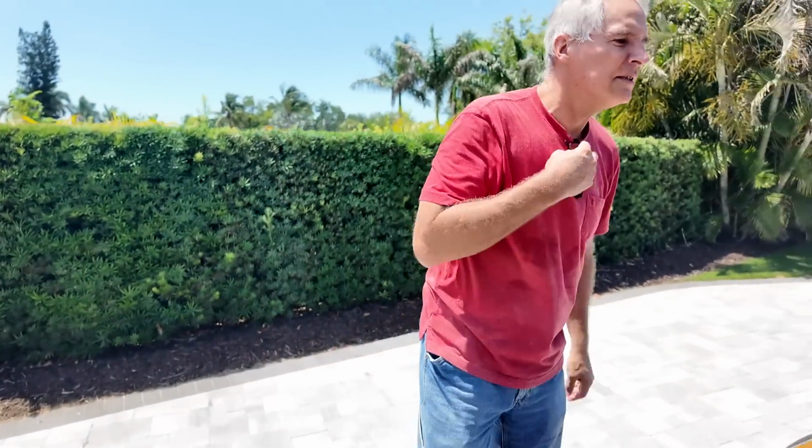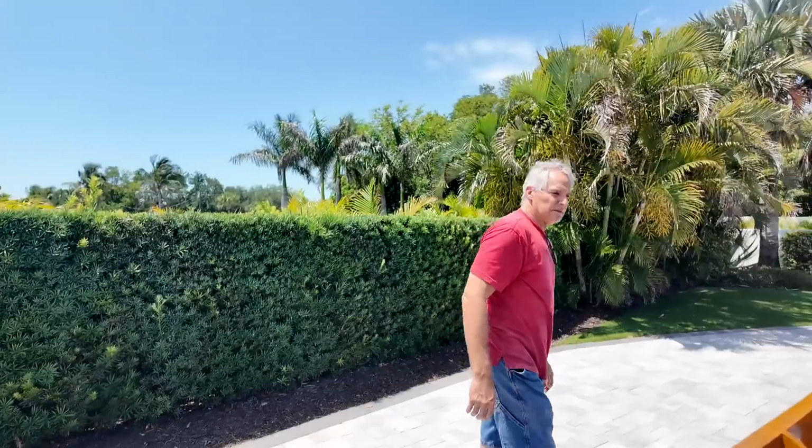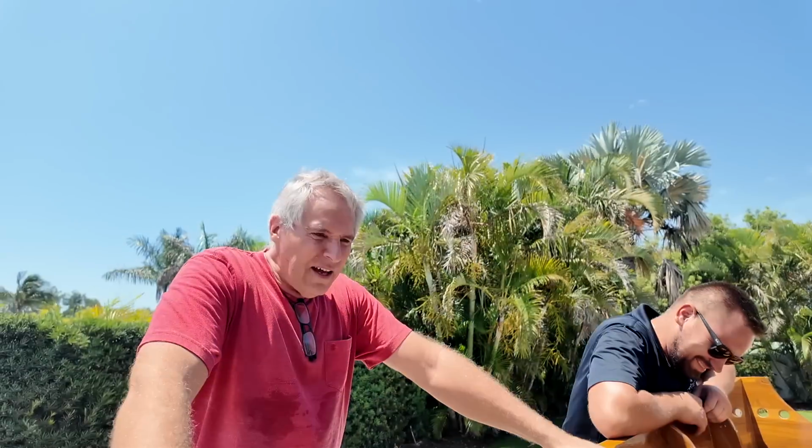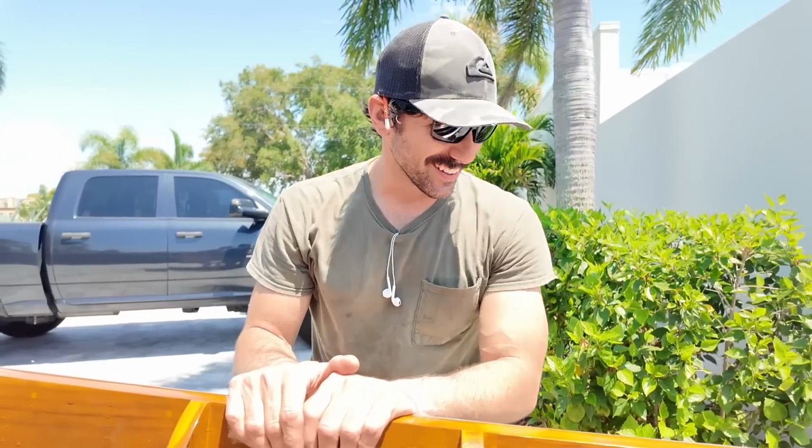It's not enough that you'd have to be worried if you had a bilge pump, and especially if you could plane out and had a little drain on the back. It's not a structural problem. If somebody knows more about this, I would love to hear your input. But that would only be a temporary fix. This is obviously gonna need to be epoxied, full penetration, but it's gonna have to dry out first. Were you planning on bringing this down to Boca Grande tomorrow? No. That's what I was wondering. You're like, we need it fixed for tomorrow.